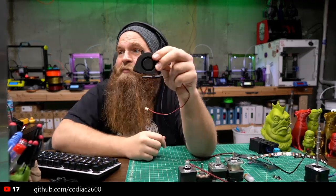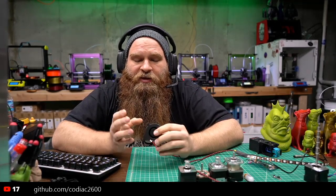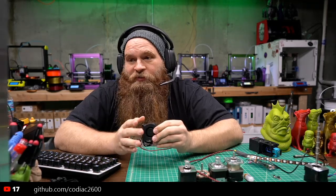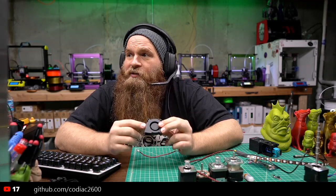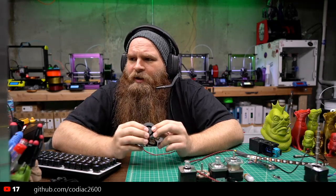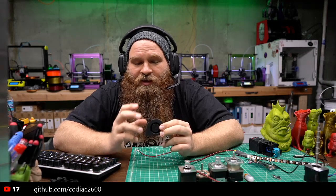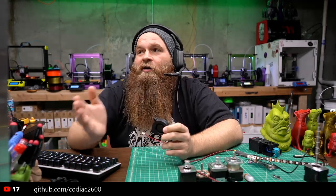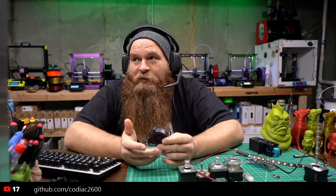So when you have these big blower fans, they tend to work what's called PWM, where it's sending a pulse signal, and the signal tells it how much voltage to send to the fan. So when you're PWM scaling, that setting that we were showing earlier, what's going on is it's sending that signal to tell it to, hey, send this many volts. So 0 to 255 is 0 to 100% fan. 255 is max PWM, 0 is off. At least most fans, 0 is off.